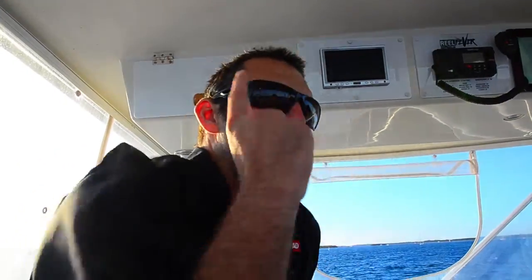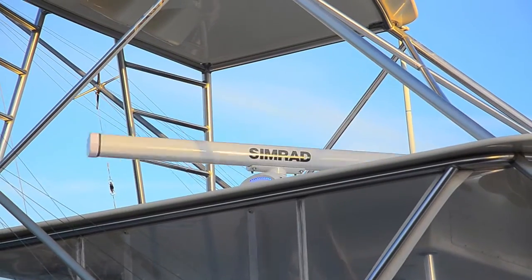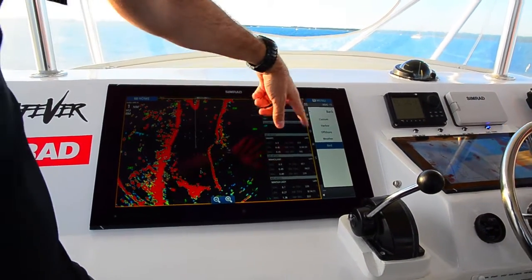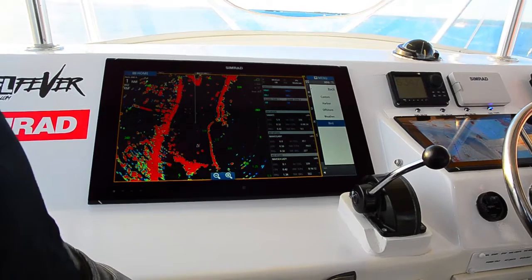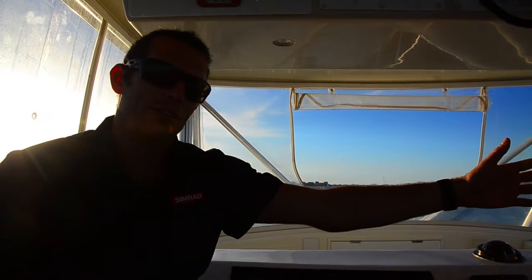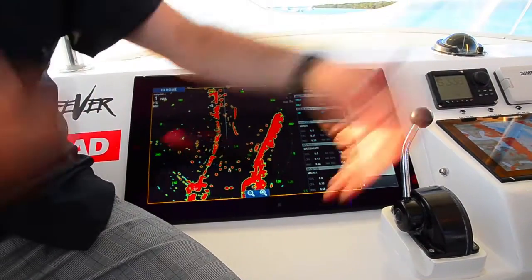In harbour mode the antenna goes around at 40 RPM. In bird mode it slows all the way down, sometimes to 12 RPM. If it sees a target, it'll actually slow down even more to get more power on that target, and when there are no targets it speeds back up — so the sweeps aren't even uniform. We're sending out seven or eight different beams in each pulse: the longer pulses go through the rain cloud and the shorter pulses hit it, so you get the ability to see a rain cloud and a target out the other side.